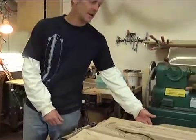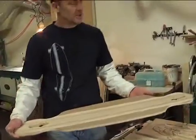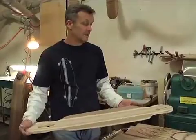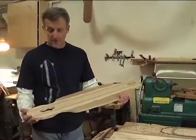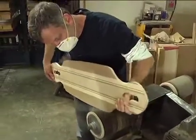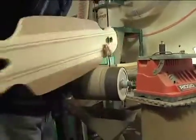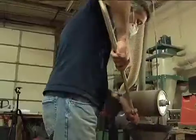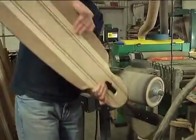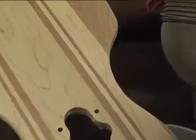We've just cut our board on the CNC machine, and we've got a Rogue shaped here, and we're going to take it over to the sander. Just because these are cut on the CNC machine, there's still some handwork that goes into this, and some personal attention that goes to every board. So let me take it over there, and we'll dress it up, the edges, and finish it off for you. So what the sander does, we're able to dress up the edge, slightly round off the corners, and then get a little different radius here for the wheels. And last step is to get a final sanding, and it'll go to finishing.